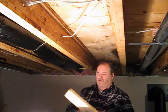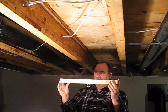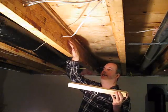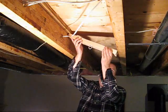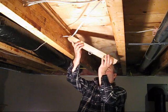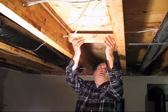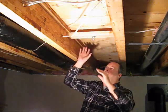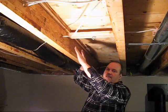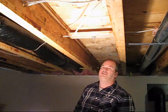I had to take the braces down because I knew I'd never be able to get these 2x4s in there with them on. I like to cut them to pretty fine tolerances, so I measured quite accurately from the inside of one joist to the inside of the other. As you can see, it's not going to fit straight — even if I try going sideways. You have to get them in with a bit of ingenuity — twist them around and put them up. I'm going to do all three of them that way, then fit my braces back in and move the supports around until they fall inside the cutaways inside the braces.